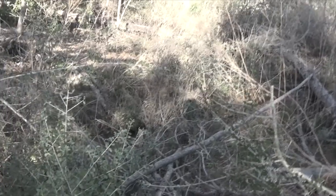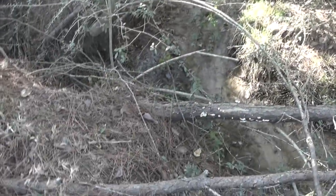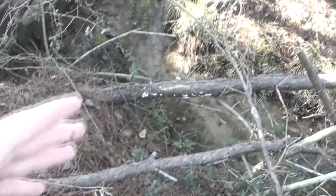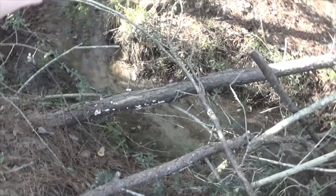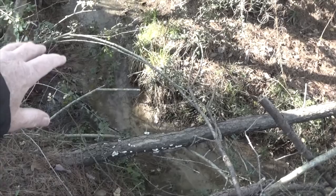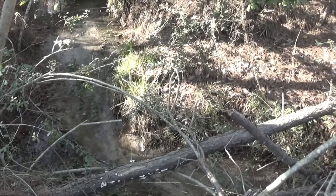Measuring the water flow has been very problematic here. This is going to be the location where we're going to set in a dam. This area right here is high — it can be reinforced with some rebar. Some bags of concrete can be placed down in here in order to make a reservoir. The collection screen will be back in here, and then the flow line will run. We'll probably use something like poly pipe.